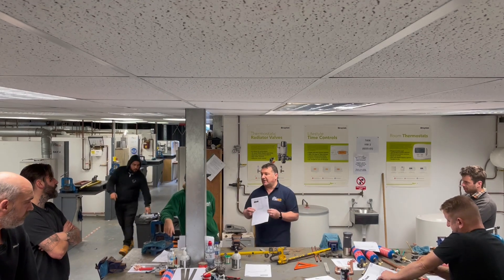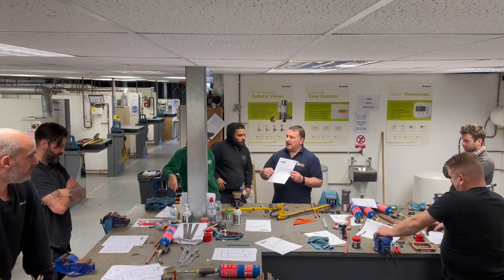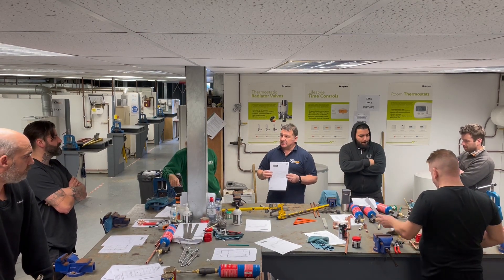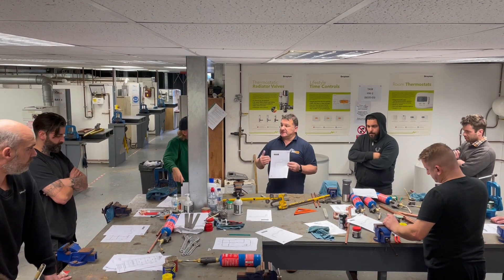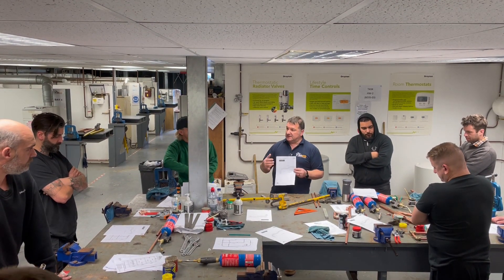Here's the thing: hold that thought, because we're putting a 90 degree into it, so something happens — we'll get a little bit of growth. And then we've got a parallel offset, which means it's going to come back to us a touch as well. So hold that thought as we go through it.